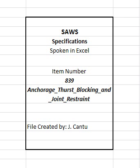10. When specifically requested by the contractor and approved by the engineer, the maximum soil lateral load bearing capacity that will be allowed for the design of thrust blocking shall be 5,000 psf. 11. When soil lateral load bearing capacities of 4,000 psf or 5,000 psf are recorded for design of thrust blocks, copies of soil tests made for determining the lateral load bearing capacity of the subject soil shall be submitted to the engineer for approval.